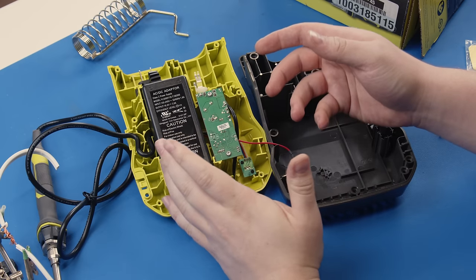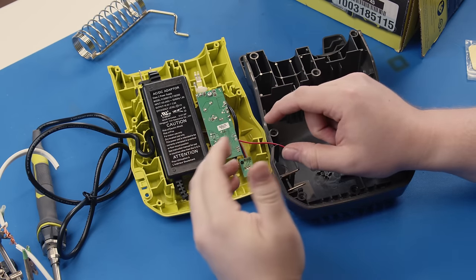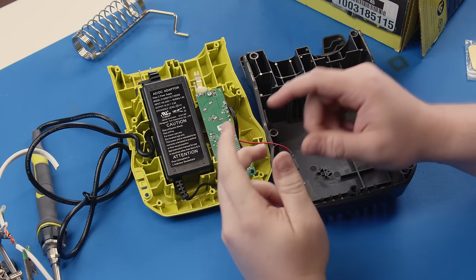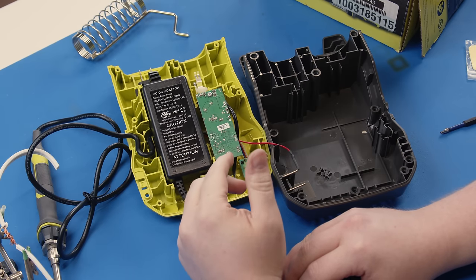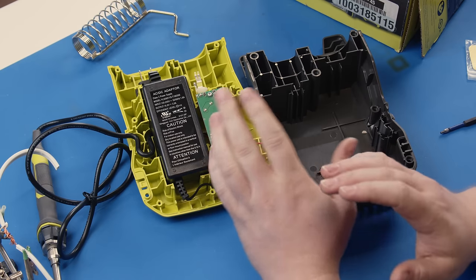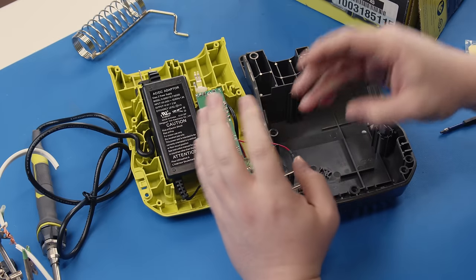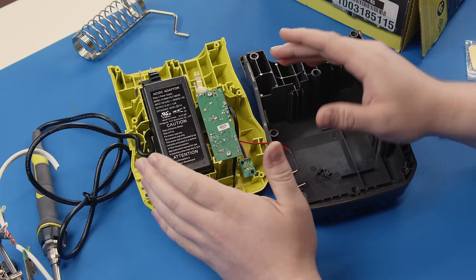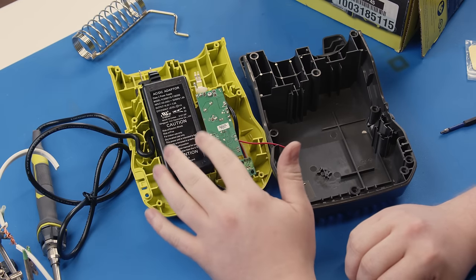Back in the 80s and 90s, even companies like Sega and Nintendo would buy pre-built RF modulators from some other company. There's not that many components in them, but they have to get certified as a complete unit. So if they buy the finished RF modulator and put it in their game console and then just plug their composite video into it and have the antenna cable come right out the back, then they don't need to go through the process of designing the thing, but they also don't have to go through the process of getting it certified. So it saves a lot of time, money, and complexity in the development process for the product, but it's still usually not quite this egregious.